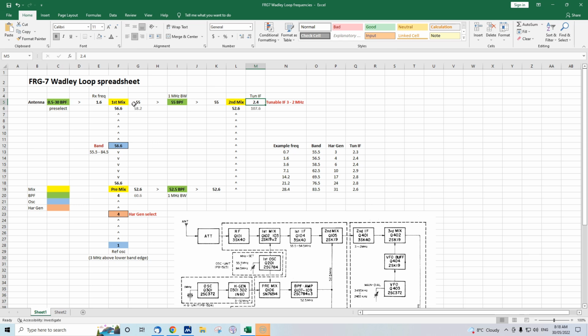The thing is though that this 55, this frequency changed a little bit, and unusually this frequency down here changed as well. It went from 52.5 to 52.6, but because we're adding up here and subtracting here, it all cancels out. Our drift here cancels out, so we remain with the good frequency stability. We'll go back to 56.5, and this could drift by quite a bit. Let us have an even bigger drift.